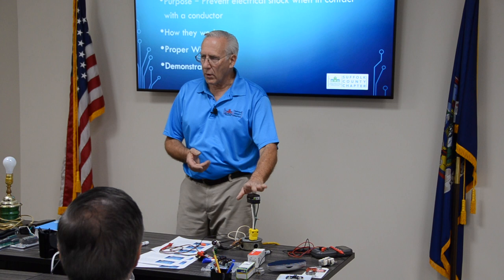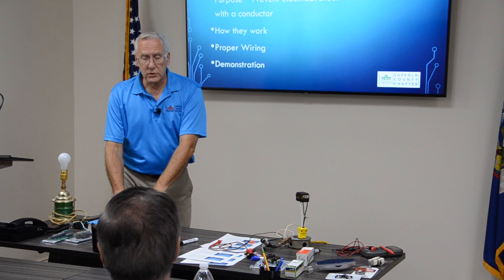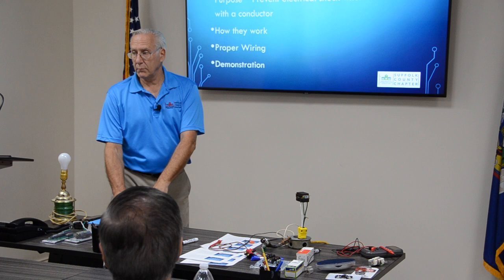But it's good to have a little understanding of how they work. They don't need a ground, they'll work. You hook them up right, and then they're working, and they do go bad every once in a while, where they won't reset. They'll work, and they'll work good. They'll protect your life. And this is only to protect human life. Most of these code changes are not because they felt like changing the code. They're a result of people getting hurt, people getting killed, people getting electrocuted, people getting burned. Okay? Proper wiring, how they work,